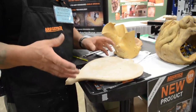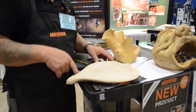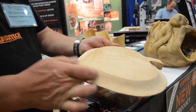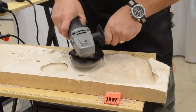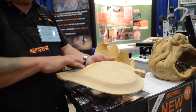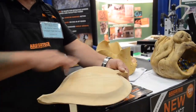You're going to start with a template — draw your template out. I bandsawed the shape out on a bandsaw, then drew a few lines on it. I drew the line around the underside as to how far I wanted the underlip to go. Then I used the 4-inch Arbortech Turbo Plane and hollowed this area out with the Turbo Plane on both sides, clamping this to the bench so that it stayed put while I did the carving.